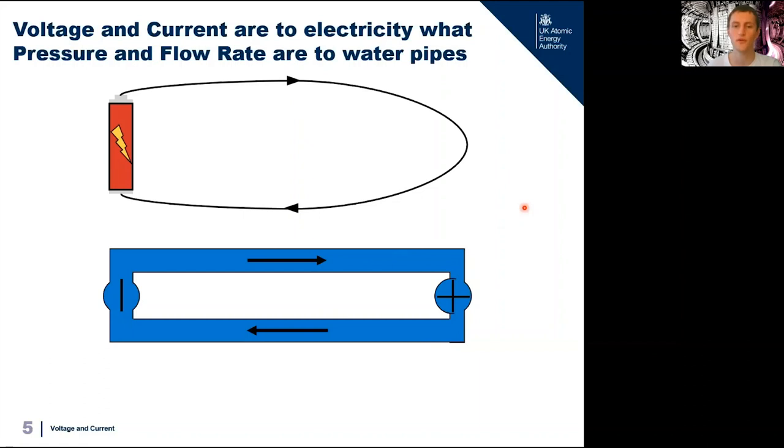Both current and voltage are fundamentally linked. If we multiply current by voltage we get the electrical power in the circuit, and the source of this power is the battery. The power in the flow can then be extracted using some component — in the water circuit example, a paddle wheel converts water flow into rotation. This relation means that because we fix the power by the source, we can have a low current high voltage flow or a high current low voltage flow, both with the same power. This will be useful when we talk about transformers.